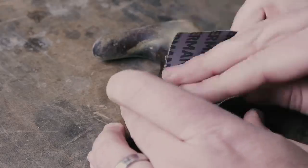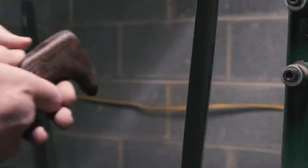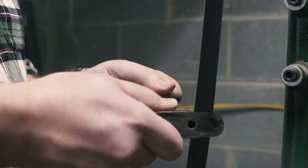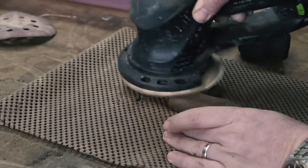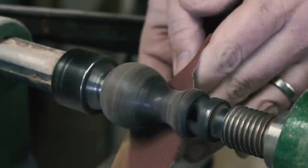There are a lot of ways to remove the old finish: hand sanding, the side of a chisel works great for scraping, if you have a belt grinder that works well, and of course the ubiquitous random orbital sander. If you have a lathe that makes pretty short work of the knob, but you could also chuck it in a cordless drill or drill press.